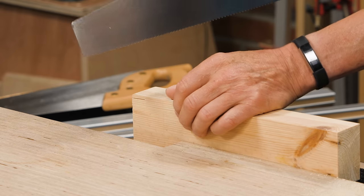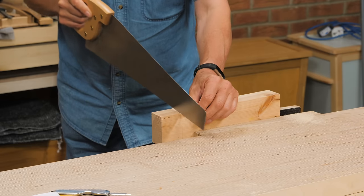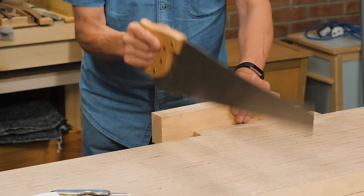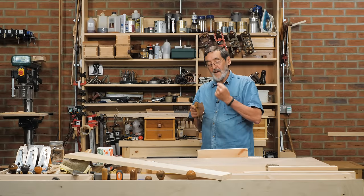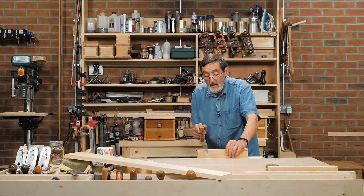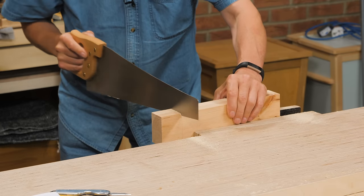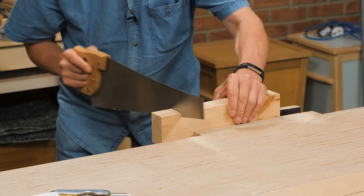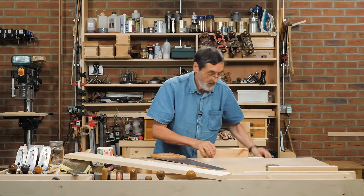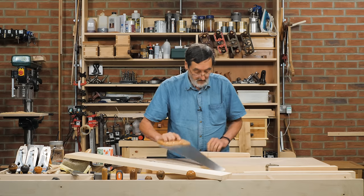Put your thumb on the side, fingers on here, pull your body — arrange your legs and feet — and then just square cross cut across here. That furrow is guiding the saw, making sure the saw stays square. Very light — not a bulldog grip — you want lightness in this. Go down here, start dropping the hand with the stroke, down, down, down, like that. So we're already about halfway through this piece of wood.